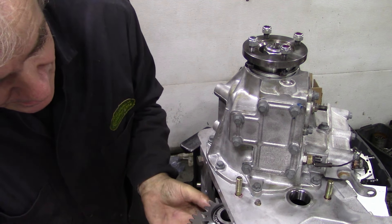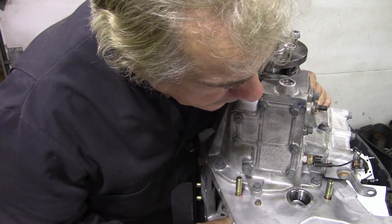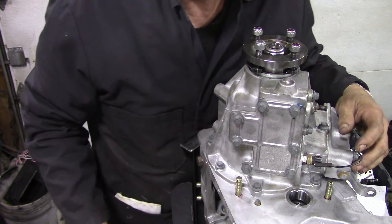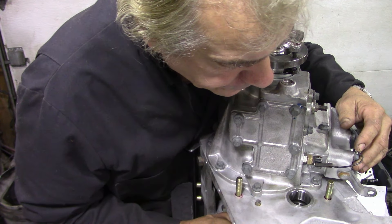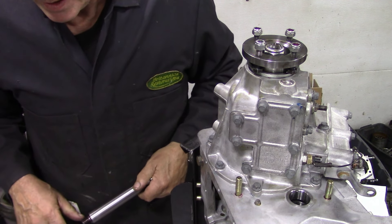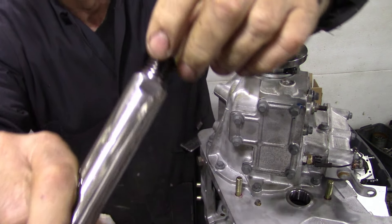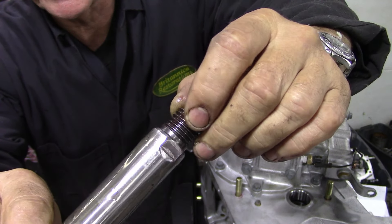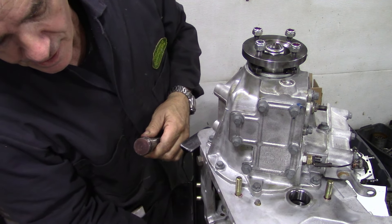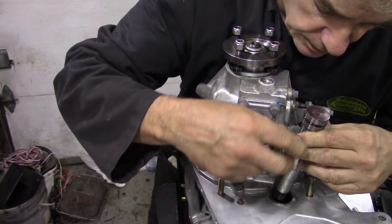You don't need all those bits of wire and string and stuff like that - it's easy. We line that up and get some oil on this shaft. We've already got the shaft polished off here - took that sharp edge off, we mentioned that before. Oil it up, oil the o-ring underneath. This can be tricky because sometimes you might have to take this bolt out.